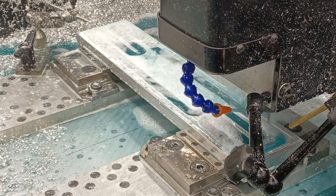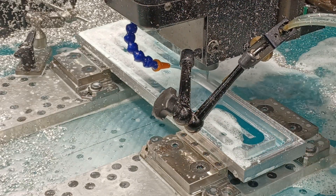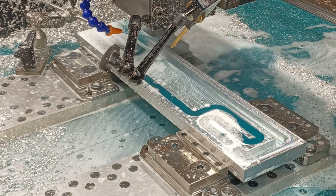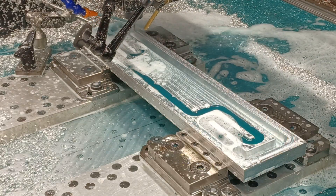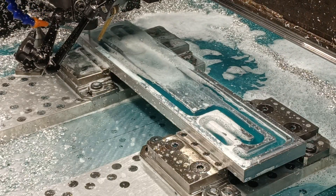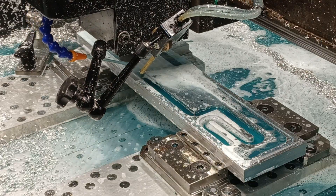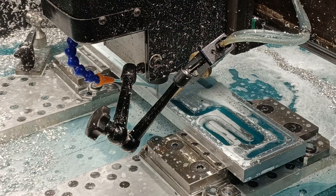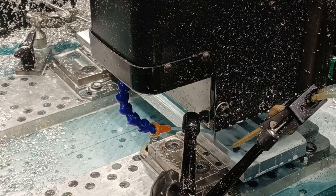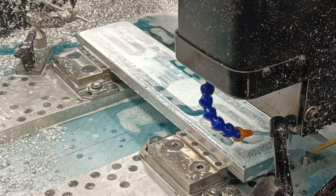You can see it slows down when I ramp - that's something that's important. You can't ramp at the same speed that you're cutting because you're engaging the bottom and the sides all at the same time, and that can snap your end mill off. So you do reduce speed when you ramp down to the next level. I think I have like a 5-degree ramp, which I wouldn't do on steel - 5 degrees isn't too crazy for aluminum, especially if you're reducing your speed while ramping.